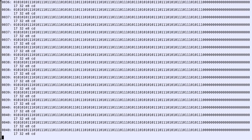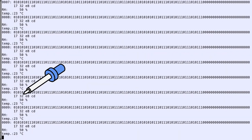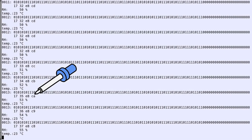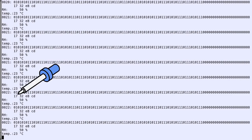Treating the '01' group as a 0 bit and '0111' as a 1 bit reveals 4 bytes. Blowing on the sensor again shows one byte value linearly decreasing while another increases — the first encodes the relative humidity as displayed by the dehumidifier, while the other is the same value negated. This is often done in infrared protocols like NEC to detect erroneous transmissions. The other byte pair encodes the temperature.